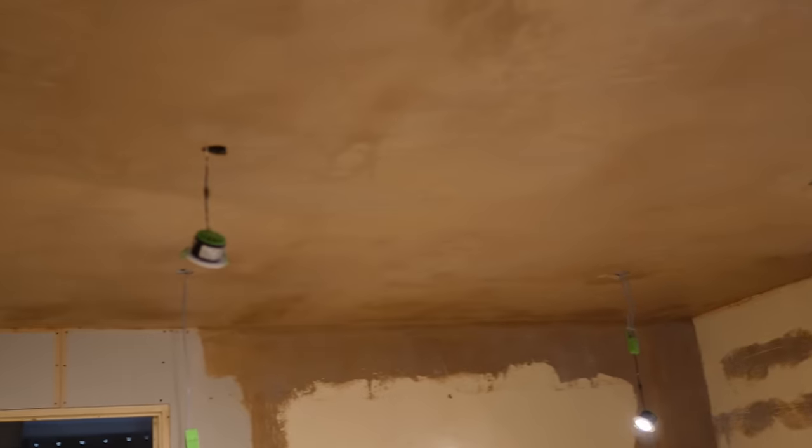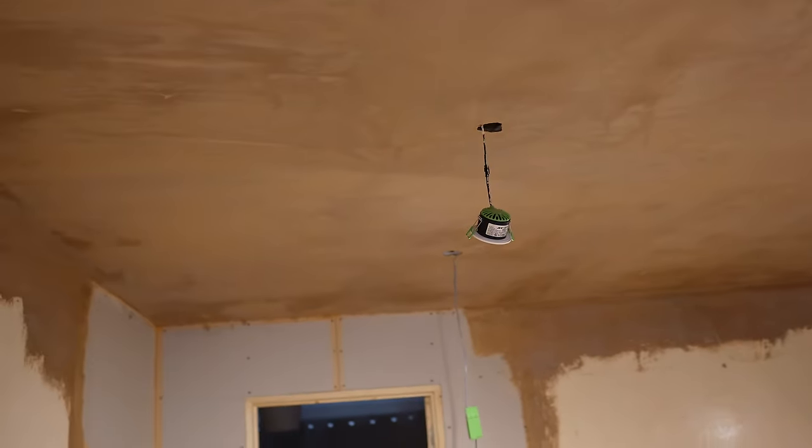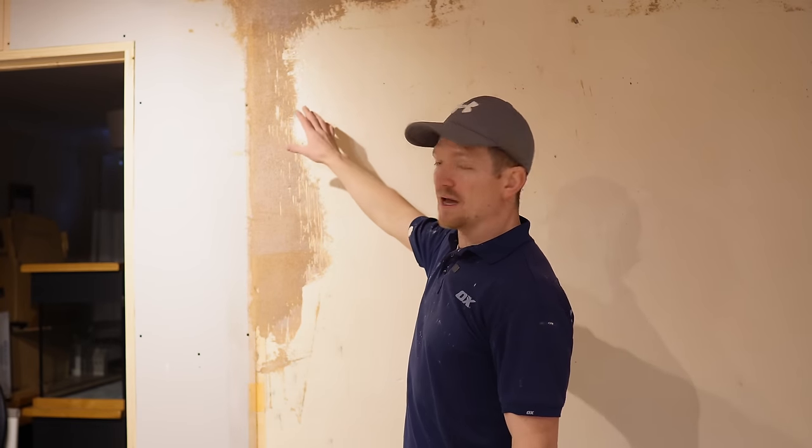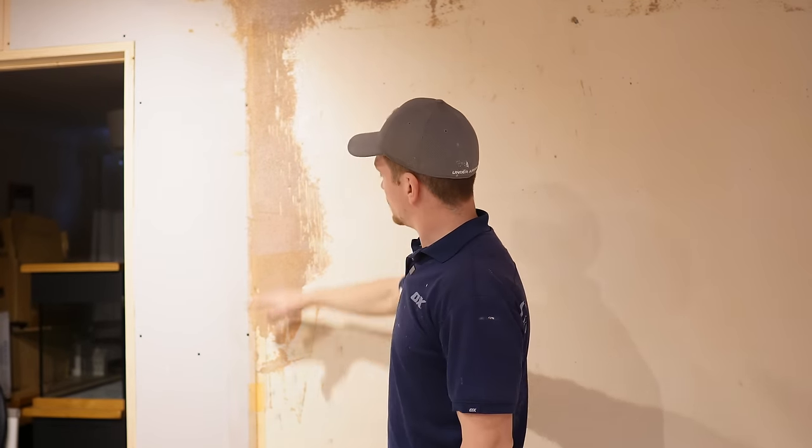It's the next day. I've PVA'd these walls and skimmed the ceiling. I'm not showing the ceiling here because I've just done a separate video on essential hacks and how to get ceilings done fast — click that link. We've got door liners to work to, plasterboard leading into existing plaster. A quick note: I've bonded out the difference between the two. Everything you want to do plastering-wise should be done in your preparation.